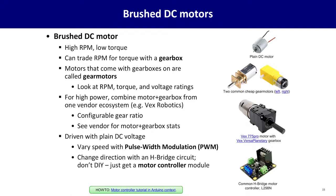And these motor controllers are typically what's called an H-bridge circuit, which is a particular arrangement of transistors so that you can ask the motor to spin forwards by applying one polarity or backwards by applying the reverse polarity. You can find lots of tutorials online on using this kind of thing. Arduino has multiple standard motor shields that integrate all the motor controller stuff to them with libraries that you can use. So you can dig in there, research these things, and start spinning some motors.